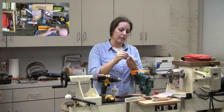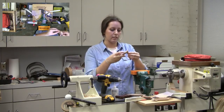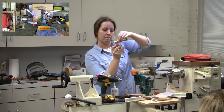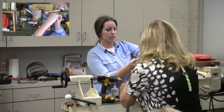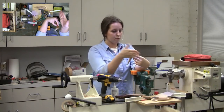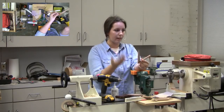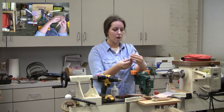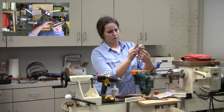But what I'll do is make sure that with my 5-minute epoxy or my West Systems epoxy, I'm covering both faces that are being glued together. I'll try to force some of the glue into that kerf from the saw so that I have glue where the spline is going to go, and I'll coat both sides of the spline that's going in so that I make sure there is coverage everywhere before I assemble this thing.